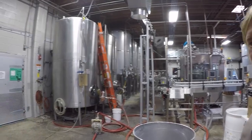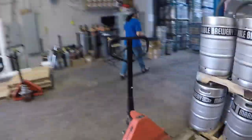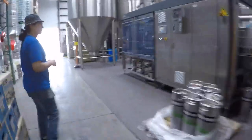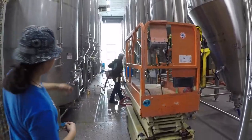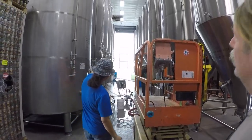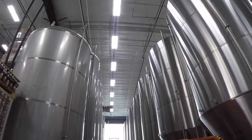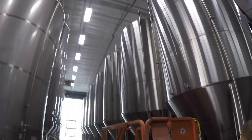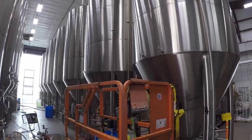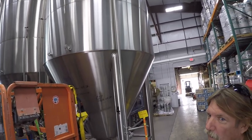And for anything else, we'll come into our fermentation hall. This is our fermentation hall — oh, the size of it! The first three tanks to the left here are 120 barrels — that's four turns in our brew house — and everything else is going to be 150-barrel fermenters, so five turns. That's usually a full shift from four o'clock in the morning until midnight.